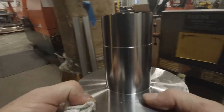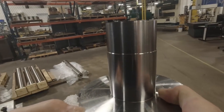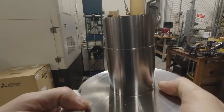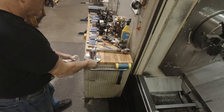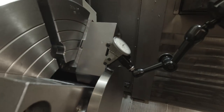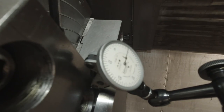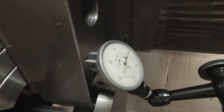Come back over to the machine. I'm going to change the chuck jaws on the chuck and then chuck onto the part. If you look carefully, you'll see that I just used a piece of strapping when I chucked onto the part. So I'm only actually chucking, you can see it there as the chuck rotates. See that piece of strapping material? I'm only really chucked onto about an inch and a quarter wide, that strap,